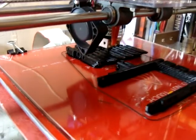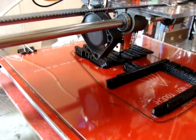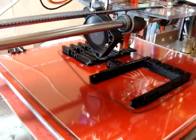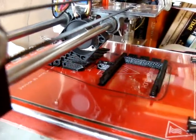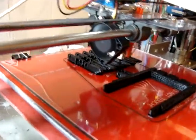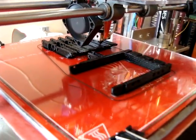Here's another trick: a 3mm brim. I do a 3mm brim around the objects before it prints — that gives a bigger surface area to stick to. And another change is to tell it to print the infill before printing the outside edge, i.e., print infill first.